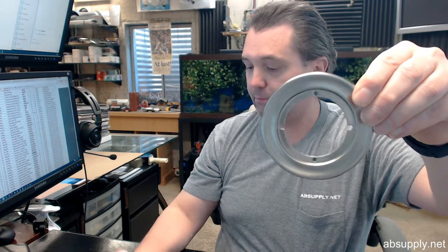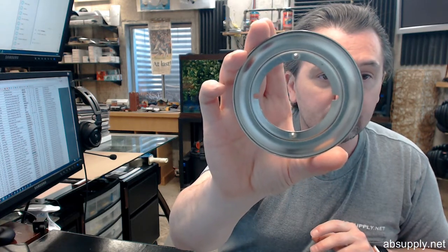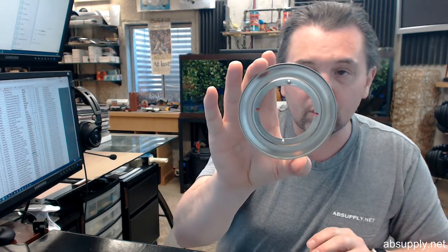This is going to have a 2-1/8 inch inside hole, and you'll notice a couple of half circles. You're going to want to install those at 3 and 9 o'clock — installed horizontally — because that is exclusively where they are installed. Locksets will typically have a couple of prongs that need to seat into those holes to prevent the lockset from rotating. This trim also has a couple of dimples on the back. On a wood door, when you tighten the lock down, those dimples seat into the face of the door and help prevent unintentional rotation as well. On a metal-clad door, you might want to locate, mark, and drill a couple of small holes so those dimples fit into them and prevent rotation.